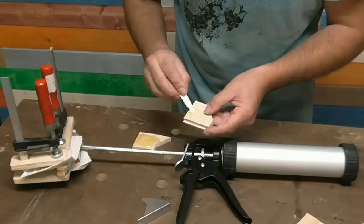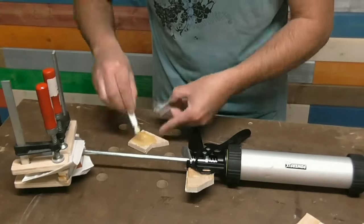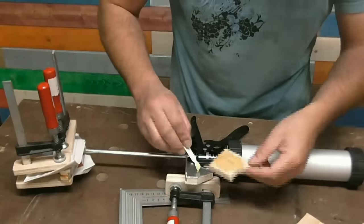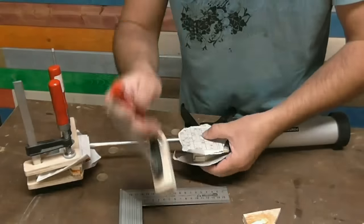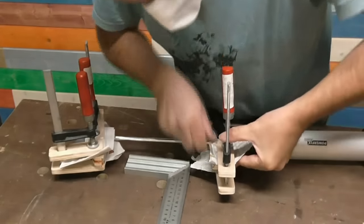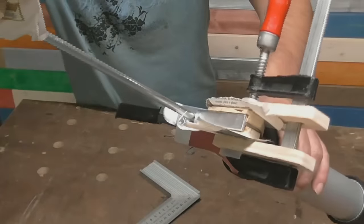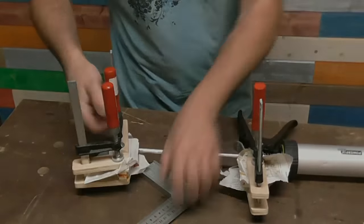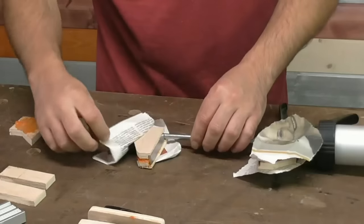Now I will glue the fixed jaw parts. These pieces are more difficult to put in the right position. And I must make sure the epoxy doesn't fall on the levers or on the rod. I let it dry overnight, and now I can remove the clamps. You can watch in my channel in YouTube how I improved those cheap clamps.